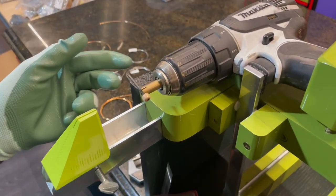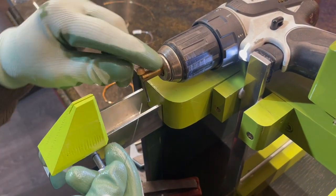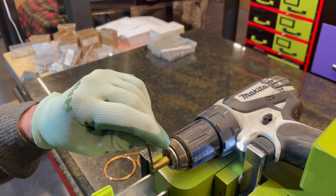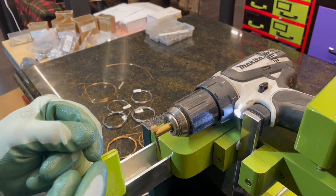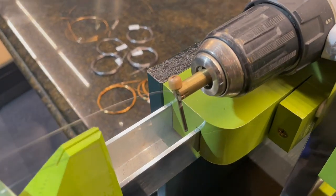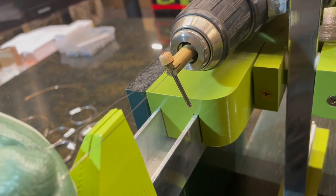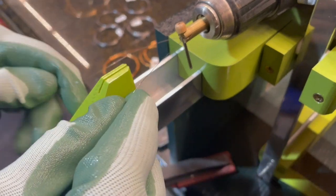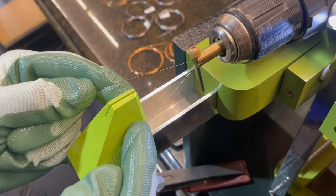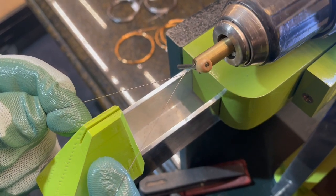The way I built the device, I have a certain nozzle with a pin. The pin has the diameter of the hitch pin on the harpsichord, and it goes through this rod. I put the wire behind the pin like this. I have to be sure that I hold it nicely. Once I put it on a sharp angle, I can just make the first cross. And then I continue.